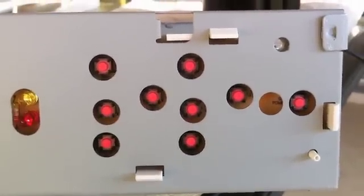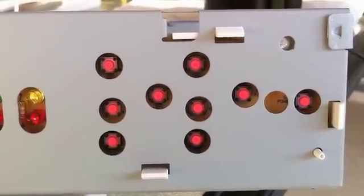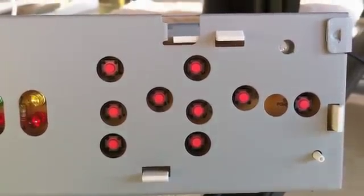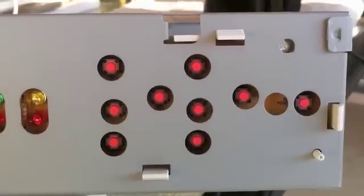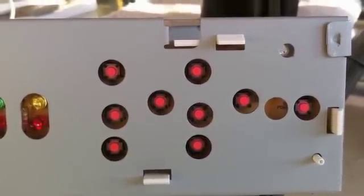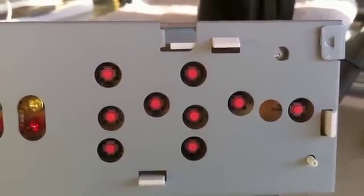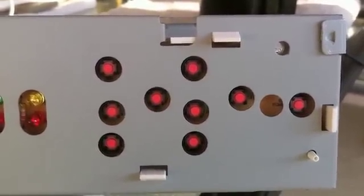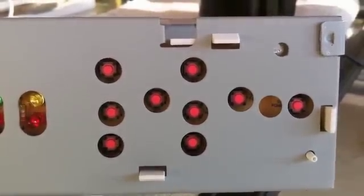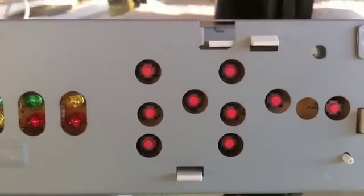Here are the switches. I'll be using up, down, left, and right for the commander. Down will be stationary position — over-determined clock mode. Up will be for when you're moving around, a full 3D position fix which will update your latitude and grid square on the move. The right button will toggle between GPS time and UTC time, and the left button will kick off a self-survey.